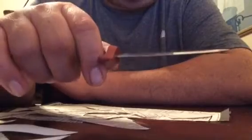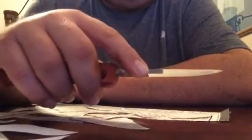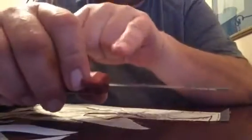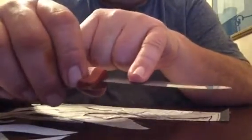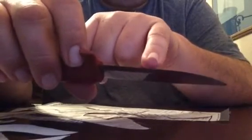As you know, for Scandi grind, you just press with the big angle that the knife has and just sharpen it back and forth, and you get your Scandi grind right away. You get those scratches right here. If you put a secondary bevel, you never touch that large angle unless you're going to reprofile. You only touch the very, very bottom, the very edge. And that's what I did. I put a secondary bevel on my Mora.